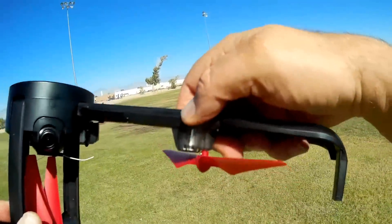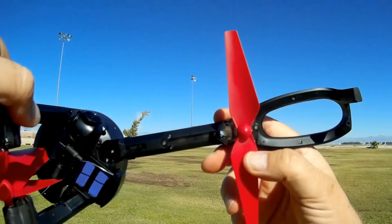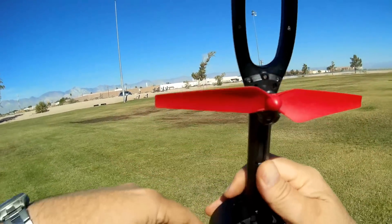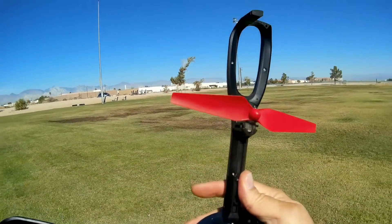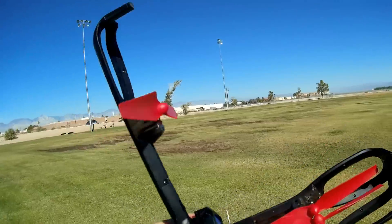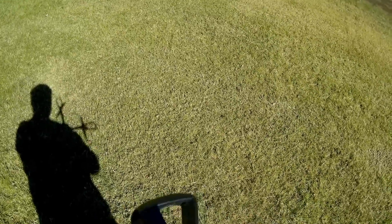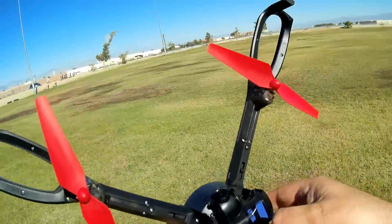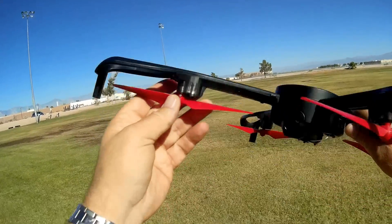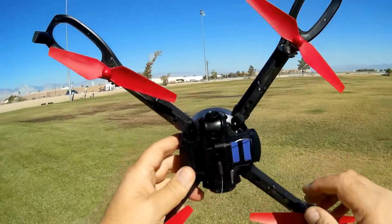I really can't see what size motors those are inside there — probably 1020s, maybe. They are good sized motors. My first impressions: this feels a lot like the old WL Toys V262. It reminds me of it for some reason — it's about the same size, probably the same size motors. They're not the same motors as the V262, which I'm very familiar with because I had to replace them so many times. But this one hopefully won't need as much replacement. Although it is a brushed motor drone, with brushed motors they nearly always need to be replaced eventually.